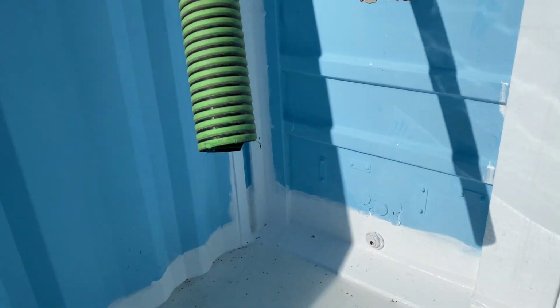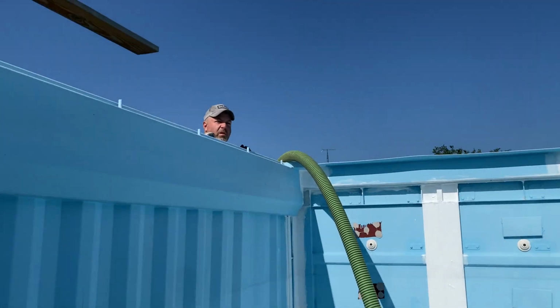The water truck is here, and I put an angled plate down there that sits against the door on top of the lip, and I used the geotextile fabric reinforcing the joints, and obviously painted on liquid plastic, so we have that around all the edges. There's the Waterman.